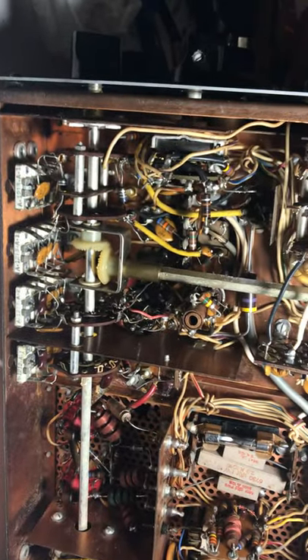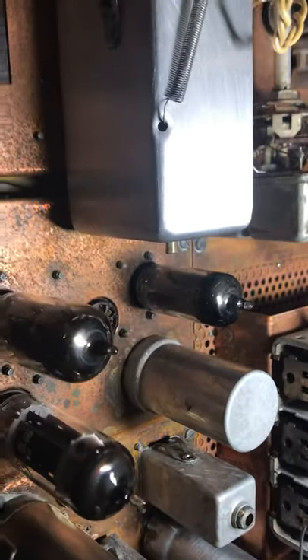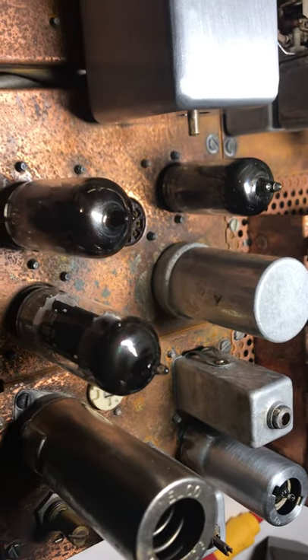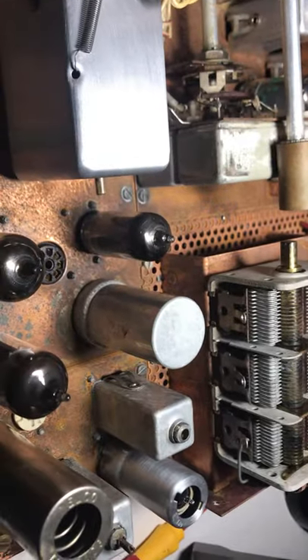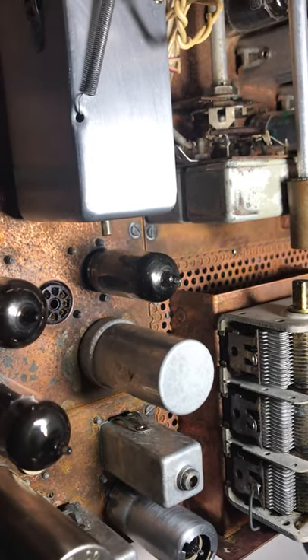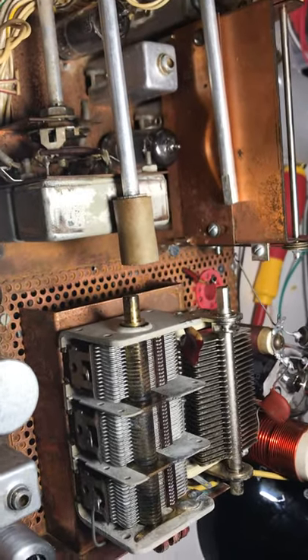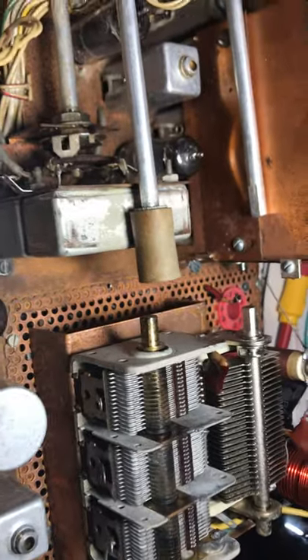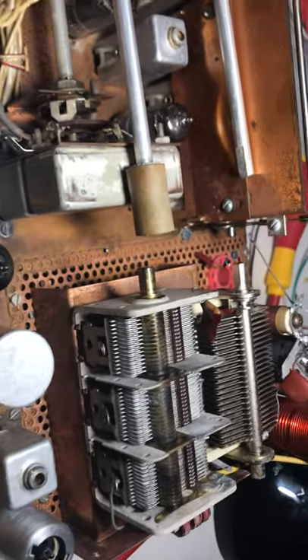I put in a new rebuild kit — an $84 kit, which I have videos on. The PIV on those new diodes is probably 1000 volts, so even back-feeding 600 volts into the power supply didn't blow it up. The new AC4 rebuild held up fine. I took the TR4 over and connected it and it worked fine, so I hadn't blown the supply. This old T4XB had blown the original power supply, so I had to rebuild it with new capacitors and better diodes, then tested the TR4 and it worked tonight.